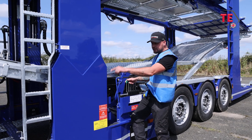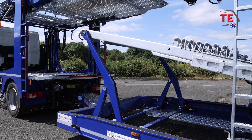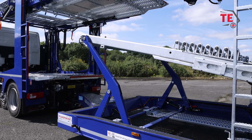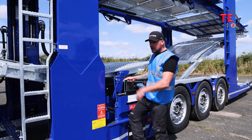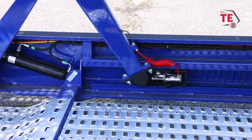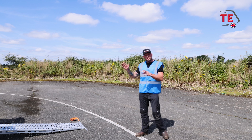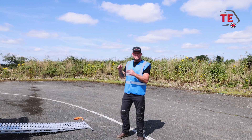Pressing the button here sends an air feed to our lock. If we release the air button, our deck will lock out. As we lift the deck off the lock, our cylinder will have now pushed the lock free, meaning the deck will go down unobscured. I've been working with these trucks for 19 years, and this is the route I take every single time we go up onto Car 11.